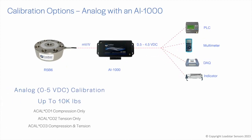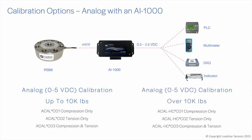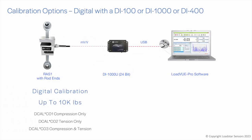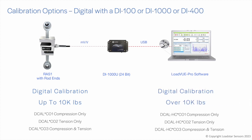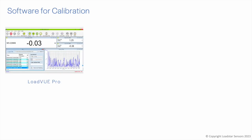When adding calibration with an analog interface, select SKUs that begin with CAL. For load cells over 10,000 pounds, add the characters HC, so you will use SKUs beginning with CAL-HC. When calibrating a load cell with a digital interface, select SKUs beginning with DECAL; for over 10,000 pounds, use DECAL-HC. For example, to calibrate a universal 1,000-pound load cell with a USB interface, select DECAL *C01 for compression only, DECAL *C02 for tension only, or DECAL *C03 for universal calibration.